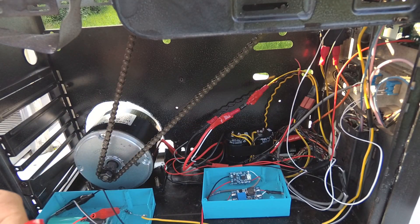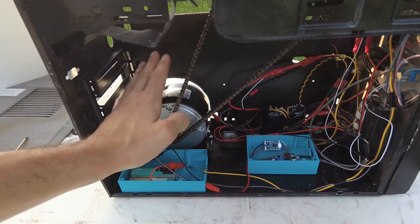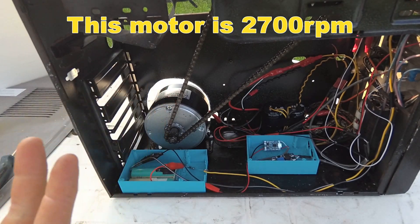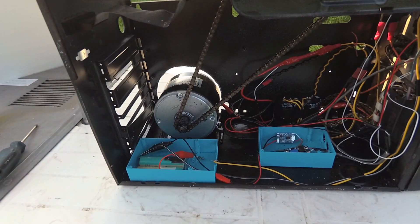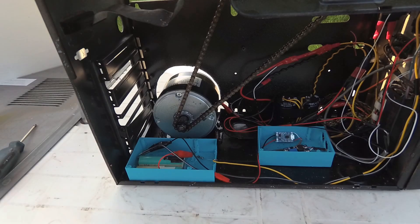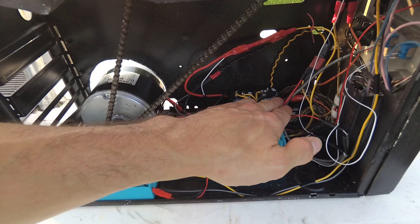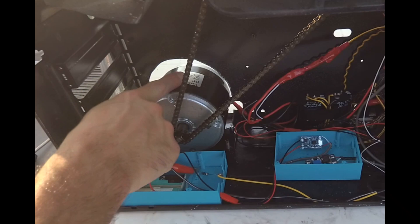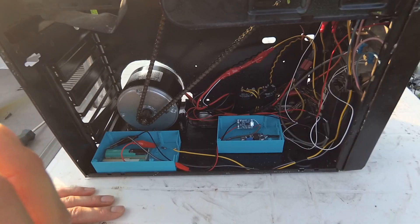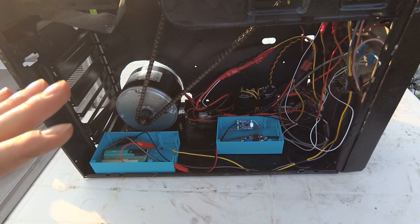The answer is right here — a diode. The diode blocks the current from going back to the motor; it only allows current to flow in one direction. With crank generators you really want a low-RPM generator, but this motor requires spinning pretty fast to get a usable output voltage. So the real secret to this whole system is right here: supercapacitors — 500 farads at 2.7 volts. I have them in a series circuit so I can put about 5 volts into them.